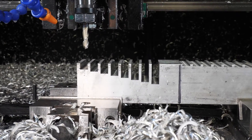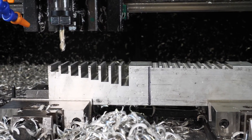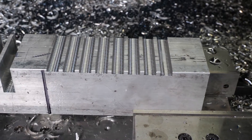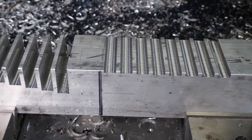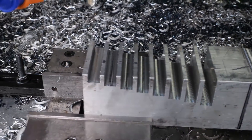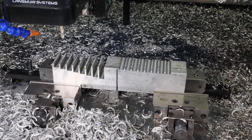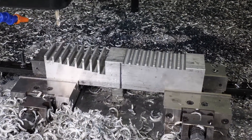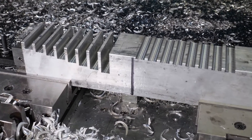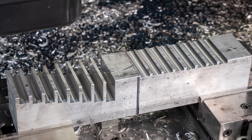The results are in. It looks like both of these methods worked pretty well. I think they're adequate machining strategies for doing full slotting on your machine. If I had to pick, I'd probably give the nudge to the low and slow method. It's just better for toolwear since it's less chip load and uses the full length of the cutting tool instead of just the bottom portion. I hope you guys learned something today. Thanks for watching.